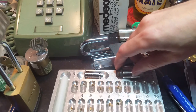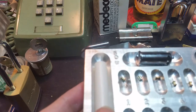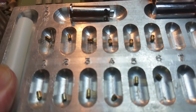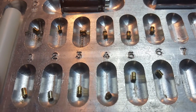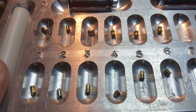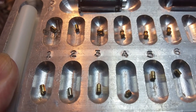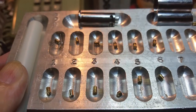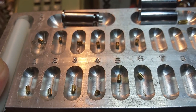So this thing is basically all spools, with the exception of that one pin, and from the looks of it, that might actually be a steel anti-drill pin. So these look very similar to American Lock pins — the serrated spools are the same basic design, and the serrated key pins are the same basic design. But the addition of that standard anti-drill pin makes it that much more difficult for someone to drill into this thing. So now we've solved that little mystery. We'll get back to actually picking things in the next video. Thanks.